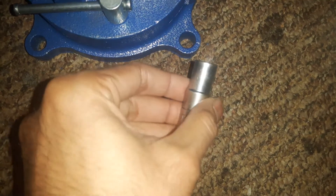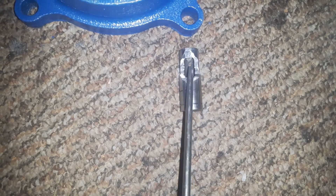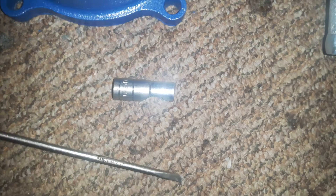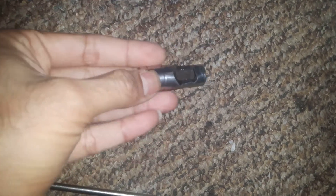The other option, which I've already started, is to make a hole and use a long flat head screwdriver that goes through the hole and holds the adjusting screw while you tighten it. This screw is going to be held. Instead of cutting all the way through — which actually makes the socket weaker — I'll grind more up here so that the flat head can go in as straight as possible. The space is very tight there.